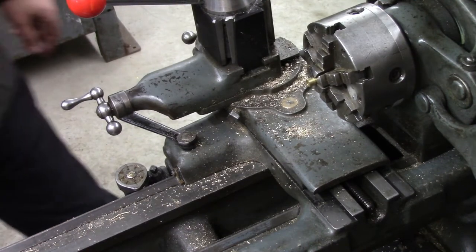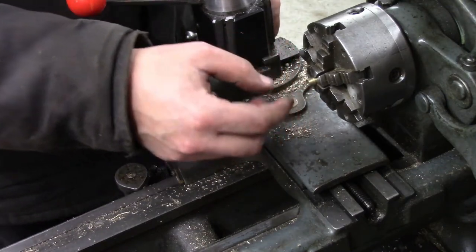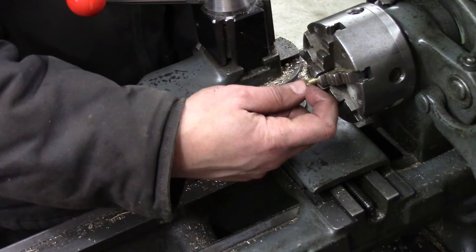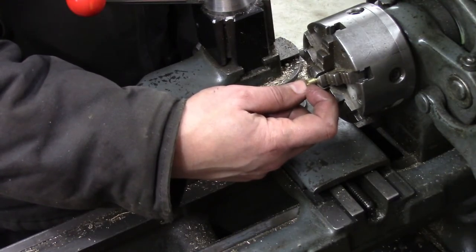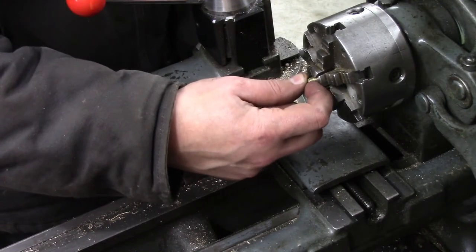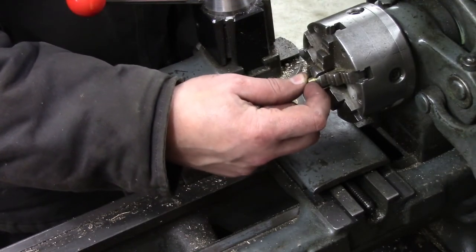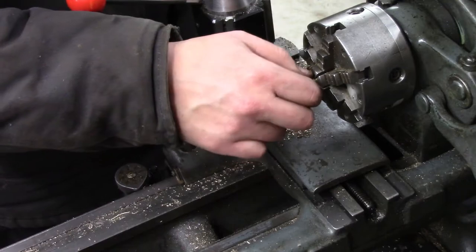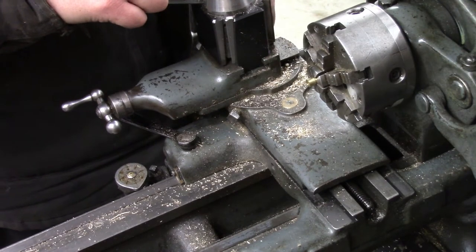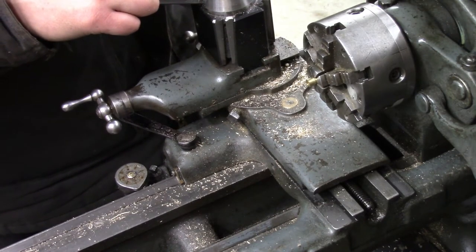What happens here is I make a small little threaded insert that goes in there. That's only an eighth of an inch long. And that leaves a gap down in there for an O-ring. That way you don't have to try to do an undercut in there behind those real fine threads. It's like a number 10, 80 thread per inch insert that goes in there.